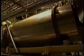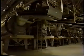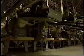The tobacco then goes to the flavor cylinder, where final flavorings are added using denatured ethyl alcohol. Denatured alcohol is alcohol which has been rendered undrinkable. It must be used in this process because these flavorings will not dissolve in water. Alcohol denatured with nicotine sulfate and methylene blue is the only denatured alcohol approved to be used in tobacco processing by the Bureau of Alcohol, Tobacco, and Firearms.